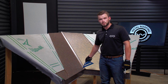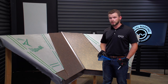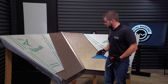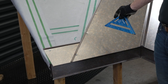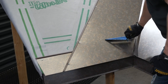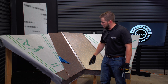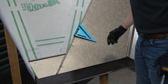Next we're going to make our layout from the low part of our valley up to the bottom of the panel. On a standard color, you're looking at a 48-inch wide or an oversized valley — you'd be looking at 12 and 3/4 inches from the low to the bottom of your panel. This particular color is a narrower master coil, so we're actually going to be running about 10 and a half inches from the low of our valley to the bottom of the panel, because we do have a six-inch minimum recommendation for the back pan on the actual valley. I'm going to use the square, place it down in the low of the valley and measure up. You can also run square off the bottom and make your six-inch mark there. We're going to do that on all four sides, top and bottom, and snap a line. I'm also going to make a mark two inches up because that's where my fasteners are going to be through the panel — so that's going to be the center of my mastic.